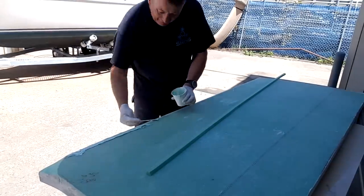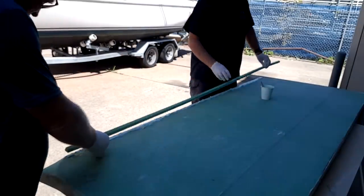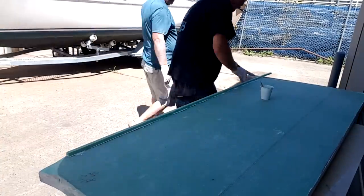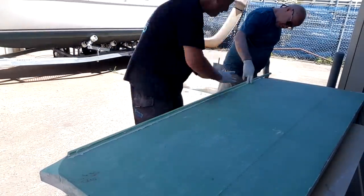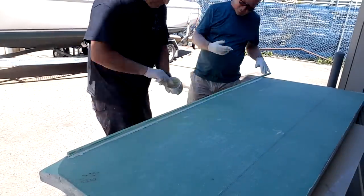On to the final part of the structure - it's a drip line edge along the outside edge of the hard top. It'll direct rain water and sea water away from the helm area and deposit it at the stern of the cockpit. It's a simple strip of 20 mil H80 foam that will be cord-filled and laminated as per the other parts on the underside.